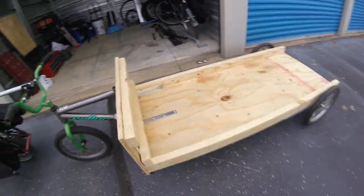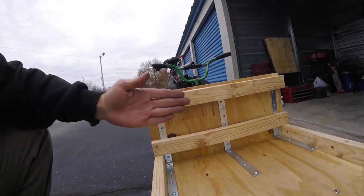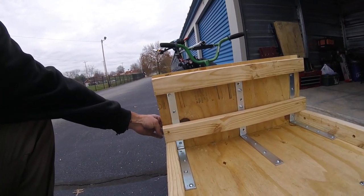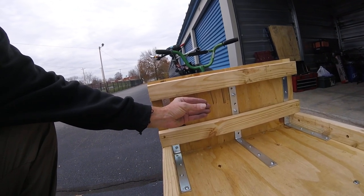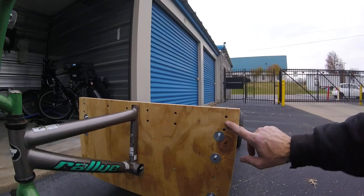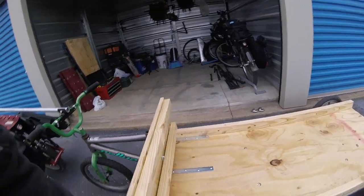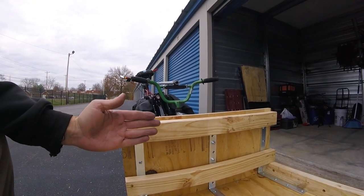For the trailer itself, to strengthen it — this piece of single three-quarter ply on the front, even with the brackets, it had some flex to it. When I tightened the bolts, the three-quarter ply was flexed. So I put a piece of two-by-three down here, screwed that in, and then I came through the three-quarter ply on the front with some screws through the brackets and through the plywood just to pull it all together. Then I put another piece of two-by-three on the top and screwed it in with a bunch of 1-5/8-inch wood screws — you can see right here all along the top. And if you look down the top of it now, there's no curvature to it. It's straight. And with this piece of two-by-three on the bottom, it's now very rigid. It doesn't have the flex that it had.